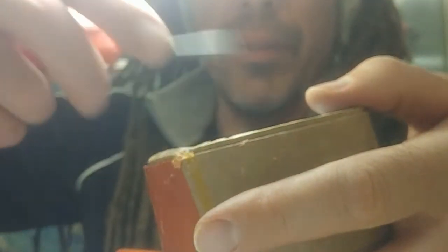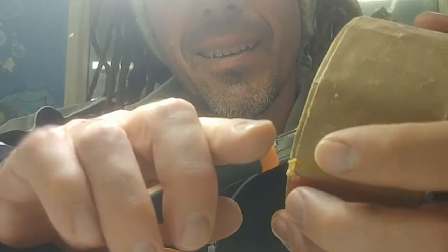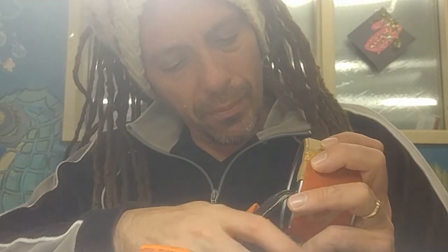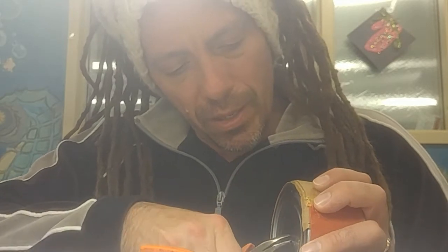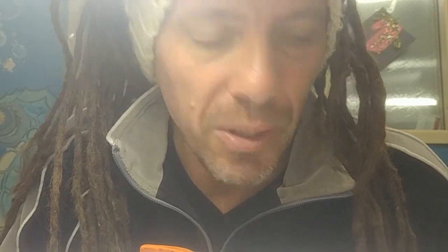When you make a hole in the bottom of the can for the power wires, just poke it all the way through and then use some pliers to kind of flatten all the little sharp edges, because you don't want the insulation on the wires to get cut. When you're building a synthesizer like this, you really should build it with a power supply that is a switching power supply that will have short protection. So if you ever build a module or if any of your wires short out, you're not going to have a transformer explode or something like that.